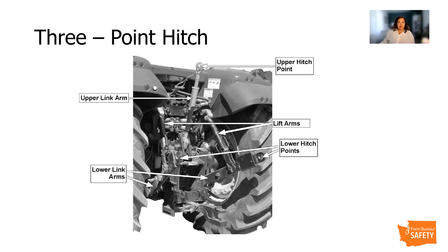Three-point hitch tractors provide a connection that links the implement to the tractor and keeps the implement supported and in line with the tractor at all times. The two lower links are the two arms that connect to the two lower attachment points on the implement. On many tractors, the lower link can be set to different modes of operation. There is the depth/position control, where the draft links are positioned and remain at the height set on the control lever — this is the setting you want to use when hitching. There is a float control, where the draft links are raised and lowered by the attached implement as it follows the contours of the ground without any interaction from the hydraulic system — don't use this while hitching. And there is the draft load control, where the three-point hitch is responsive to changes in the amount of draft load produced by the implement, automatically raising and lowering the height of the draft links to keep the draft on the tractor relatively constant — again, don't use this while hitching.